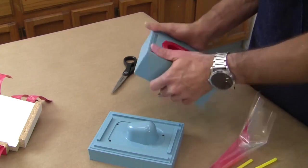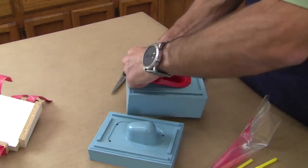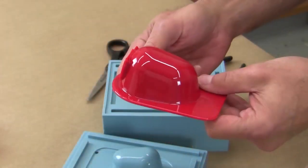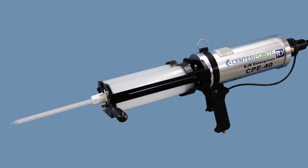Production requirements — do you need to cycle many parts in a day to keep up with production? You're going to want something faster, and you need to make sure your mold is set up correctly to allow material to get in there quick. This could mean using a tall funnel to let gravity help force material through the mold, or you could look at dispense equipment. If you aren't in a giant rush or you're new to casting, you can use something a little slower and concentrate on doing all the steps right.